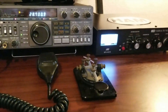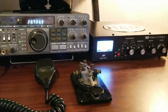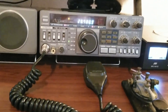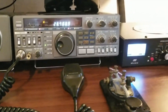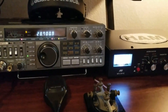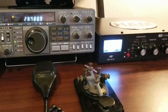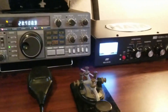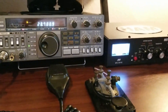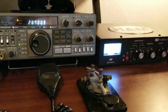As you can see, all four bands coming in from the End-Fed Half-Wave antenna — 40 through 10 meters — through the common mode choke into the tuner and the Kenwood TS430S are within acceptable ranges. The maximum I got was about 2.0 to 1. That's a bit high, but the radio won't shut down at 2.1, and the 15,000 ohm choke is really stopping anything from coming into the shack, so I'm having no issues at all.